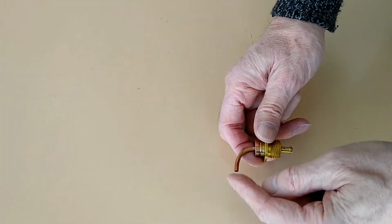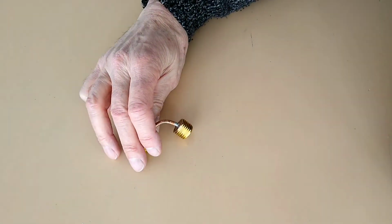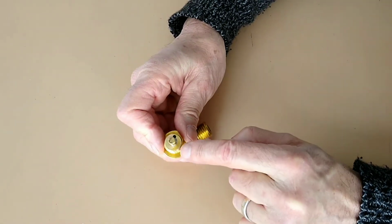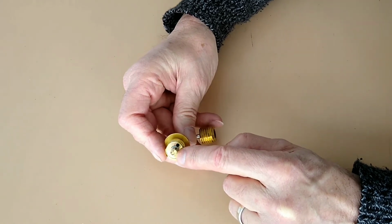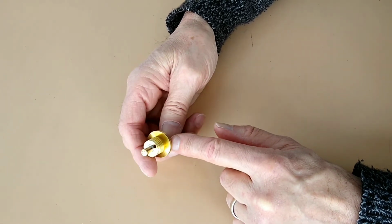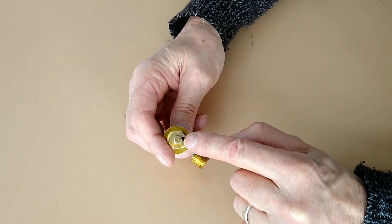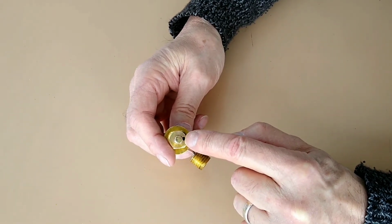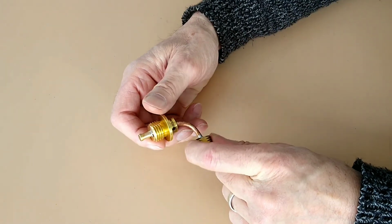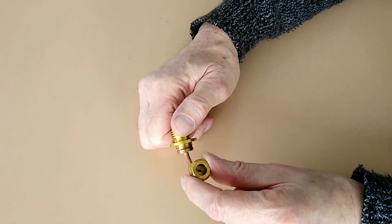And once that's done, I then solder the second piece of the body onto this end of the tube. And there's the finished item, all soldered up. So the tube soldered into both ends, and the stem also is soldered up. So that's ready to go. Put all the rubber bits back on. If in the future you decide you don't want to use the old rubber band safety valve, you can just block this hole up, as I said before, with a piece of 3mm rod soldered in place, and then you can fit another safety valve, as I did on my setup. I'll just put the seals back on, and we'll see what it's like.